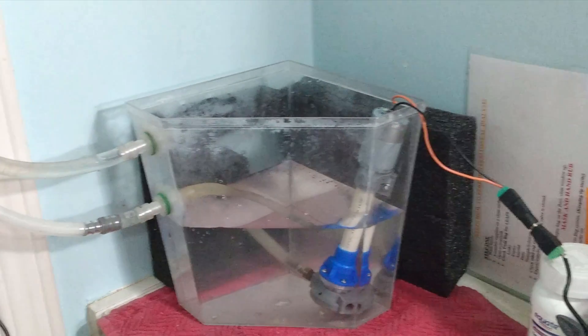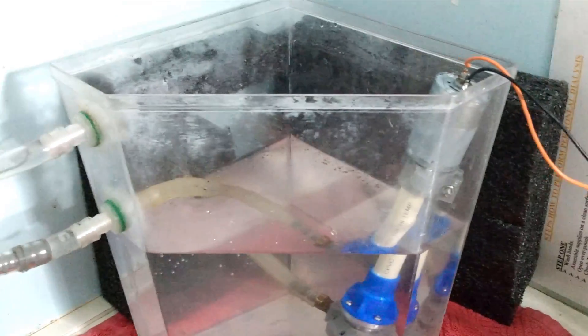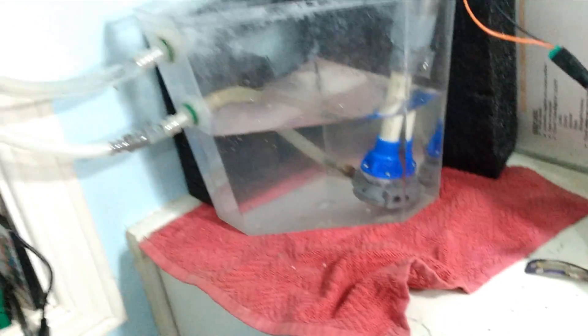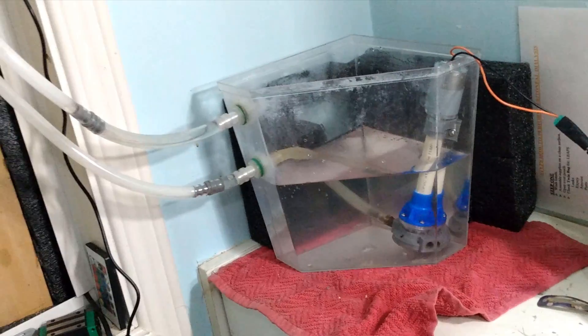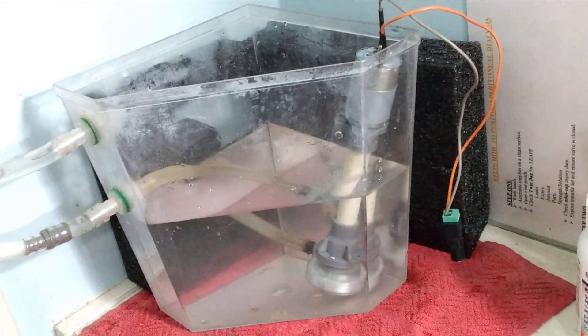However, it's rather loud. I'll fire it up just to show you — there it is. It's a little bit loud; not unbearable, but it'd be nice if it was quieter. That's why I was working on the centrifugal pump — it has fewer interfering parts and should provide enough flow and head pressure to manage this.